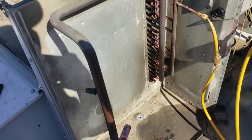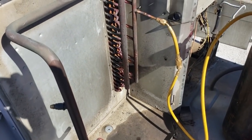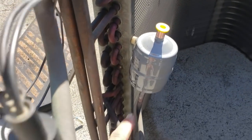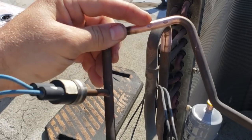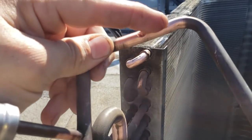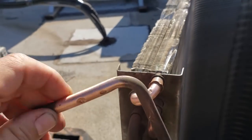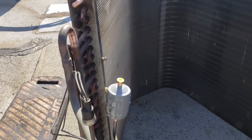I'm still flowing nitrogen through there really well and just heating this a little bit — you can see stuff starting to flow out of that. You don't want to heat it enough where the braze comes undone, just enough to melt any waxy material that might be in there. I'm getting a lot of refrigerant vapor coming out right now, I can smell it. Just heating these guys up a little bit, blocking with my finger to build pressure then letting a little bit out.